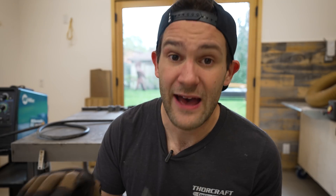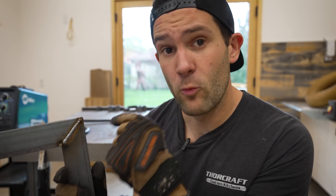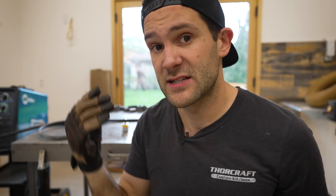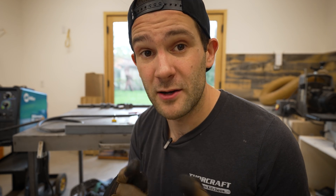If you do all of that you should have a fully welded seam. When I'm actually working I won't tack and then weld each individual seam — what I'll usually do is tack together the whole shape I'm working on and then as a last step go around and fully weld together all of the seams. All right, I think that's enough practice — let's move on to building this actual monitor mount, and while I do that I'll give you a couple more tips.